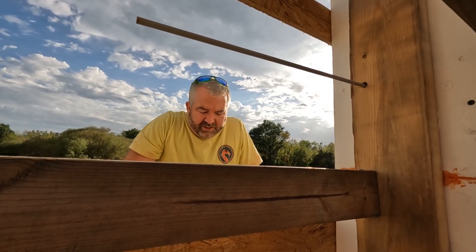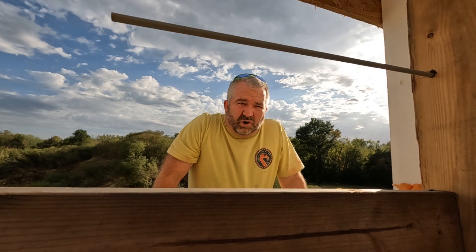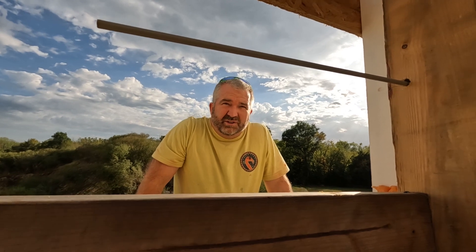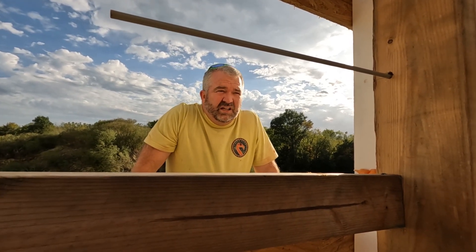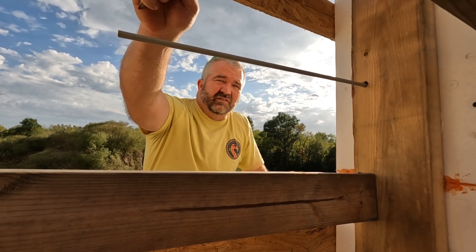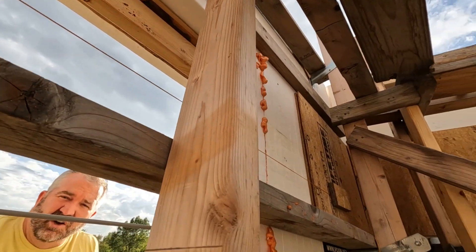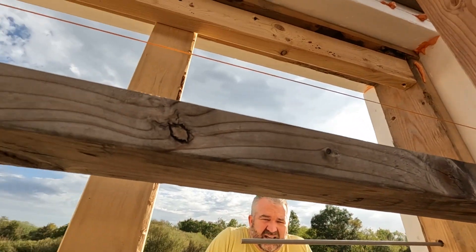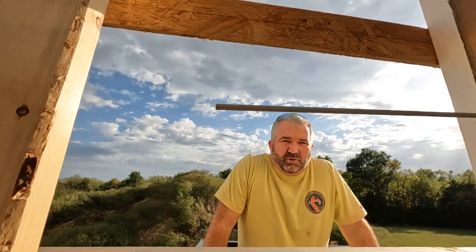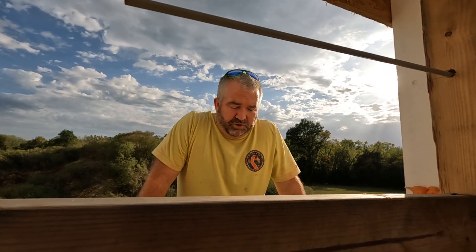Anyway, so that's what we're trying to get done. We're trying to finish up because we have concrete scheduled for just over a week away, and we have some of this last little bit of buttoning up to do. We don't have any of our vertical rebar in yet, so we got to get that done. We only have a few of our strings — we need those on all of the walls so that we can gauge off the wall to make sure that we're straight during the pour and after the pour.